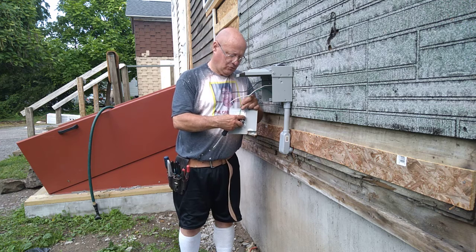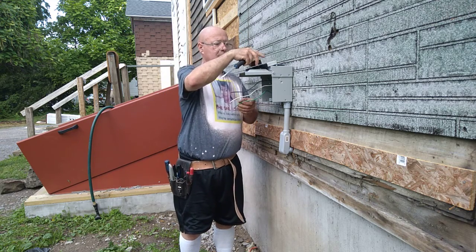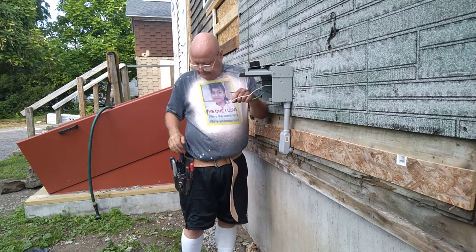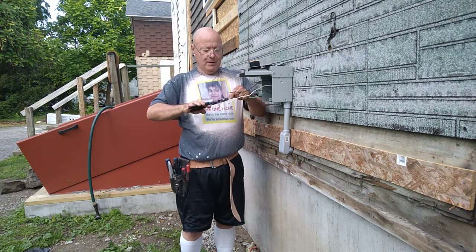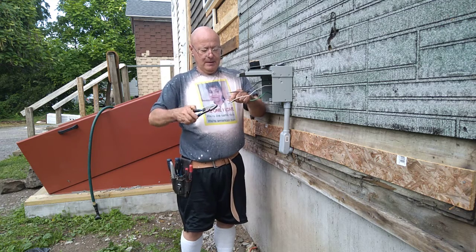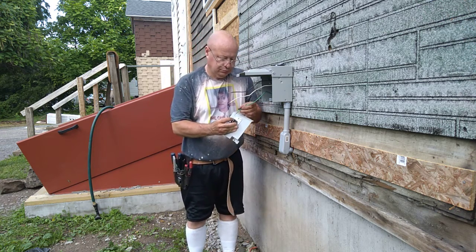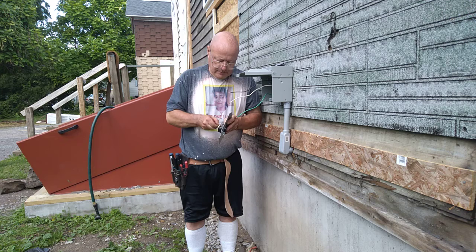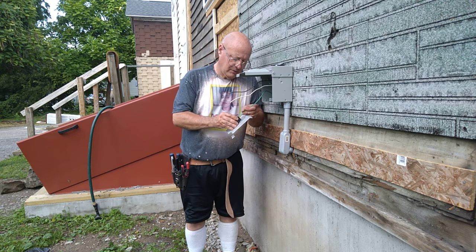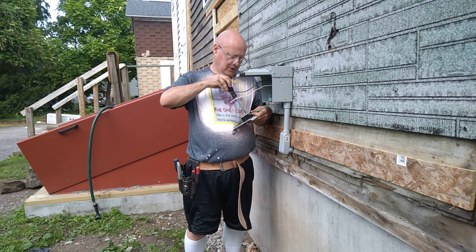Make sure all the strands go down into the hole so we don't have a bad connection. Push it in. I'm going to go back to ground zero and twist them again to make sure we get them all together. Put just a little pressure so we don't have them splayed — push it in, there we go, all in there all the way. Make sure the insulation is not under the pressure plate as I tighten the screw.